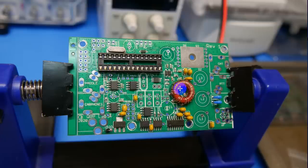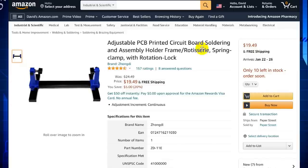There's a lot more to go on this board. The next thing that goes in is the little temperature-controlled crystal oscillator right here. The nice thing about this board holder is that it's like a rotisserie — you can rotate the board to look at the back. You put the components through, roll it over while holding the component, spread the pins apart so it holds in place, then solder them. This little circuit board holder is available on Amazon and not very expensive. You put the board in, loosen the screw, push it against the spring, and tighten the screw to hold it in place. It's an absolutely fabulous little invention.